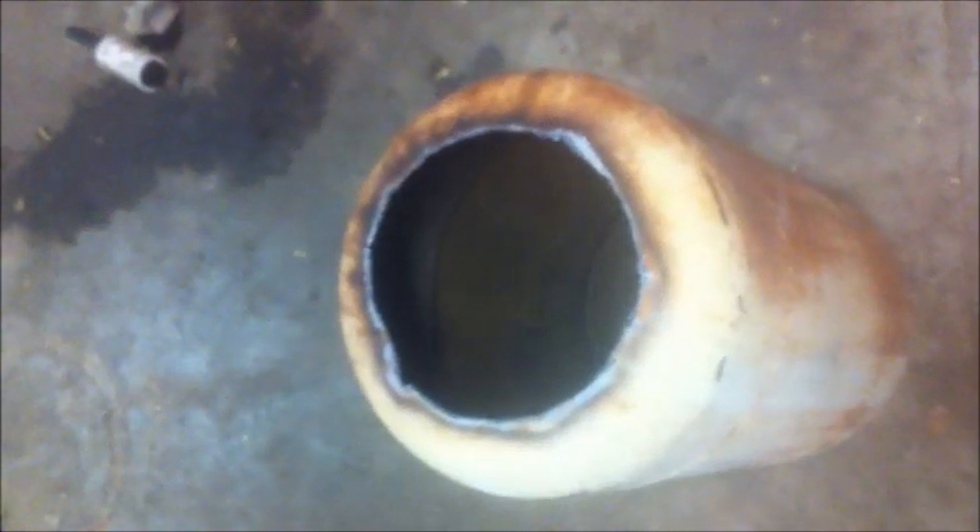Welcome back. In the past few minutes I've added to this nozzle an eighth-inch nipple, and then an eighth-inch to quarter-inch reducer, and I've cleaned all that up and I'm about to go weld it together. On the propane tank, I centered the nozzle on top, traced it out, and cut it on the inside because there's a little lip on the nozzle. On the other side I've cut that out as well. I'm going to weld this up, weld it in place in there, let everything cool, hook it up to propane, and test it before I finish this thing out.